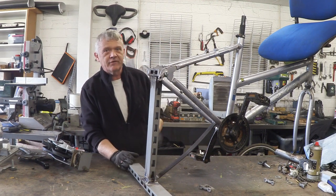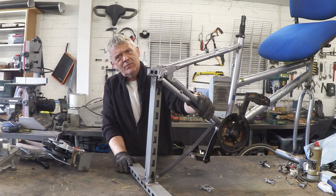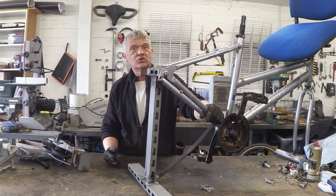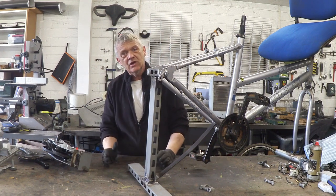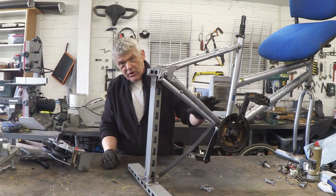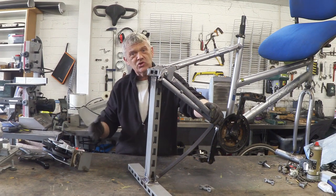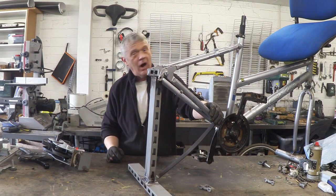It was meant to be the Swiss Army knife of pedal power. The argument is, if you connect a dynamo straight to this — you could just bolt in a generator and create some electricity, use that electricity to run your machinery — what happens is you're losing 70% of the available energy. If we could connect directly to mechanical output and use that mechanical output rather than the intermediary of electricity, then we regain that 70%. And I thought that was an awesome argument.